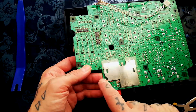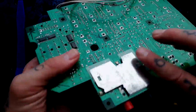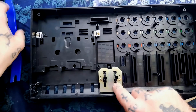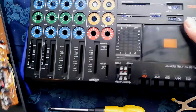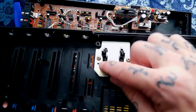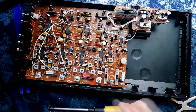The only other thing to remark on here is this bit of shielding that's actually soldered in — so if you needed to get at any of the solder contacts under here, you would have to desolder that first. This is the record arm. Be careful of this when you reassemble it: you need to line up the holes at the base of these plastic switches. There's nothing electrical here — it's just a mechanical means for switches in the upper surface to reach electrical switches mounted to the lower printed circuit board.